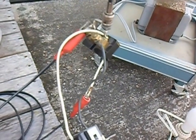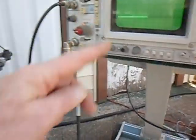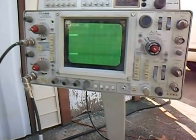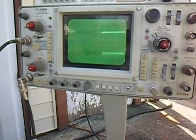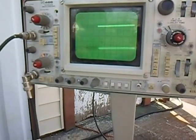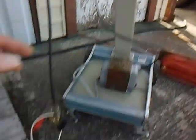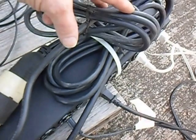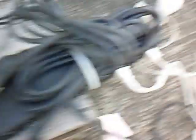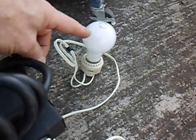We can monitor current coming out on the scope — that's going into channel 2. So channel 1 will be reading the high voltage side of the pole pig and the waveform there; channel 2 will be reading the low voltage side of pole pig number 2. For loads, we're coming out of our plug going into this power strip — a convenient way to plug multiple things in. One of the things plugged in is a hundred watt light bulb.